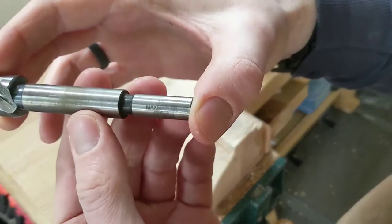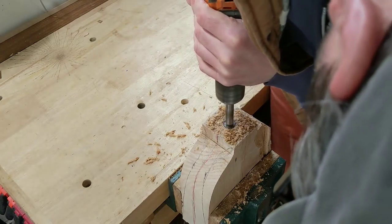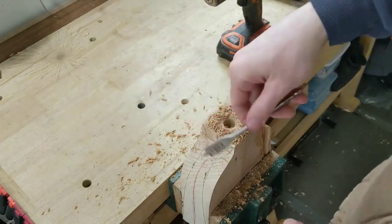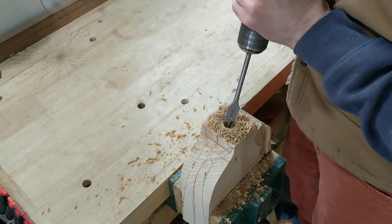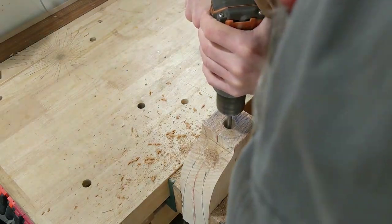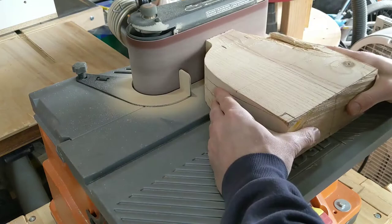The next thing I'm going to do is drill the hole in the top while I still have a nice flat surface to work from. I'm going to start out with a ¾ inch Forstner bit because that'll give me a nice clean starting hole. Then I switch over to a spade bit because it's a much longer bit, though it won't give quite as clean of a cut. So I wanted to start with the Forstner to keep things clean at the top. I go down as far as that spade bit will allow — we're just hollowing out a hole, something to stick the stems of dried stuff or fake leaves into for decoration.